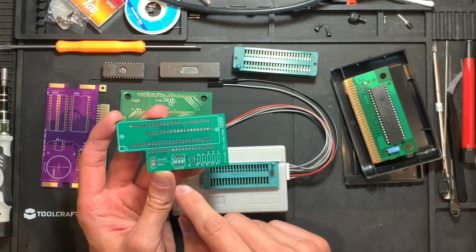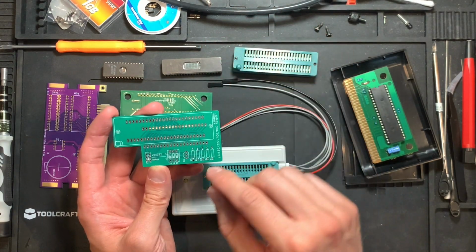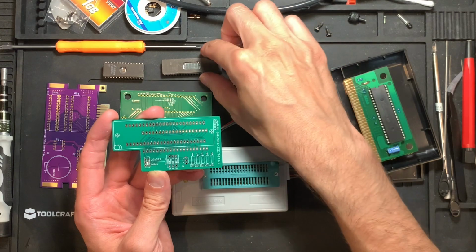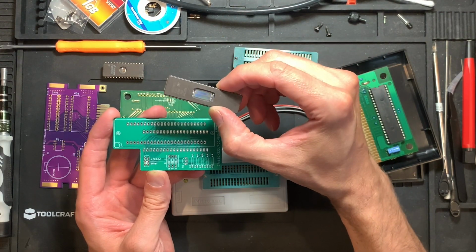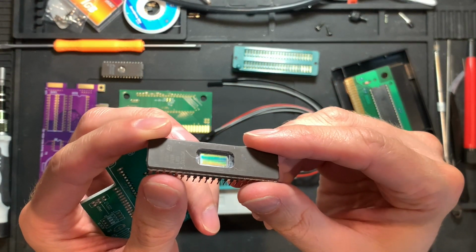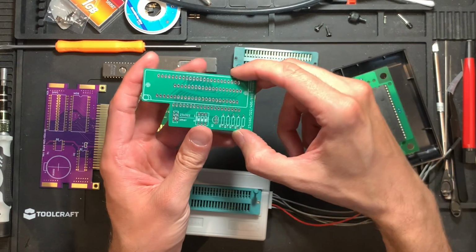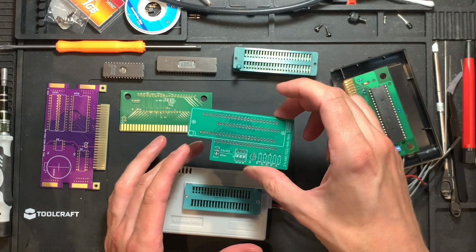And if you have the 27C322 or others that are larger than 512 kilobyte, you will use the DIP switches to select which of the 512 kilobyte banks you're using. In this chip there are 8 different ones, because it's a 4 megabyte chip, so you have 8 512K segments, which I think you can even see here as these little squares. I'm not sure if they are addressed just like that, but it helps to think of it like that. There's also one transistor and a couple of 10K ohm resistors, but that's it.